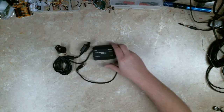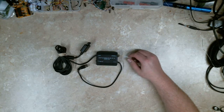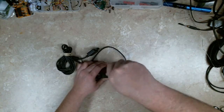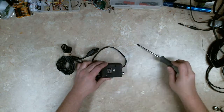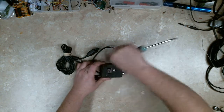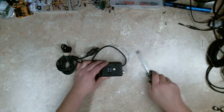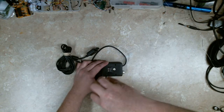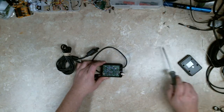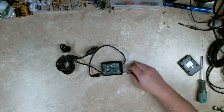So we're going to salvage this thing. I can't imagine very many people have a Nintendo 64 and would ever use this. And looks like it had been sitting in Goodwill for a while, so I'm going to part it out and just use the RF modulator circuitry as an output for the Arduino. Now I will probably end up modifying this so it has a couple of pigtails going to a RCA jack so it could plug into anything.